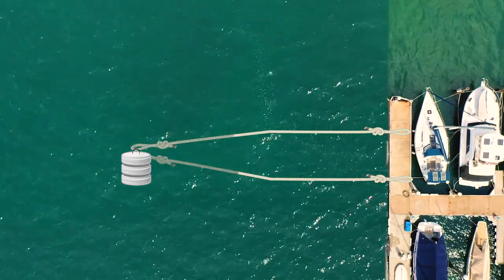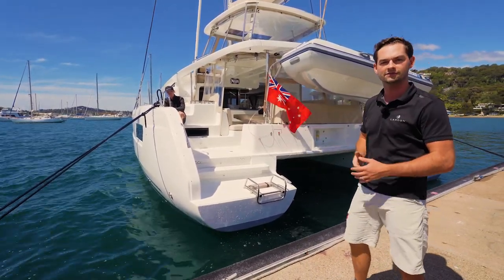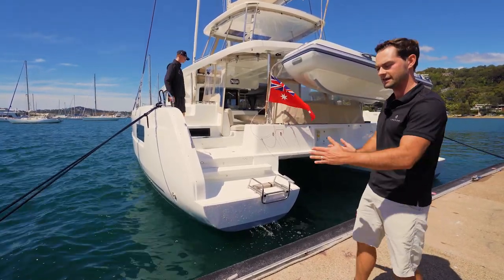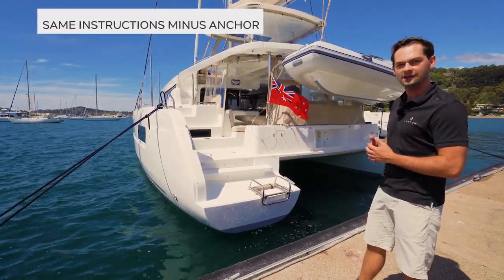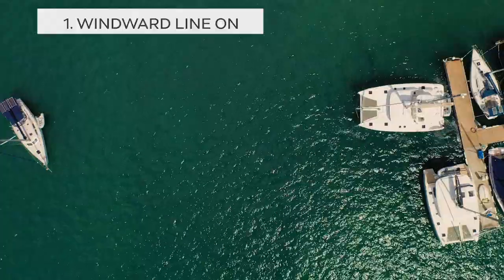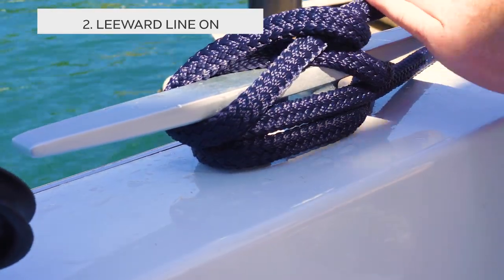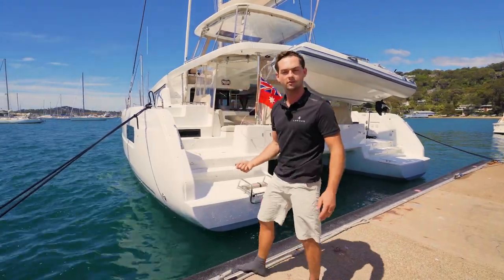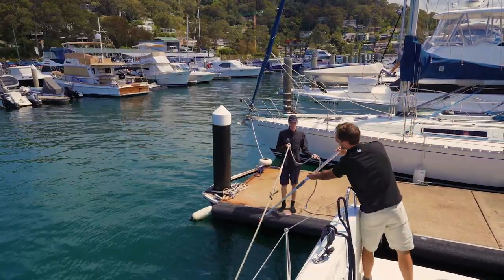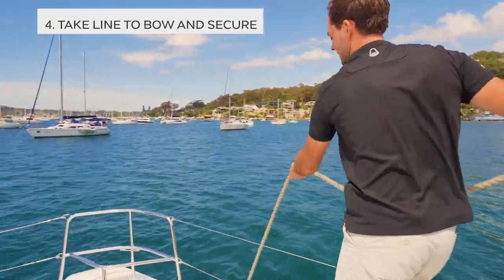There's a small line which comes to a cleat on the dock, runs underwater, becomes a big line, and then goes to a concrete block. The approach is exactly the same as before except you're not dropping the anchor — you're just reversing into the dock. Again, if there's a boat already on the dock, put fenders down one side and go on the windward side so he can catch you as you come in. If not, you do exactly what we just did: come stern first into the dock, get your windward line on, drive on that to control the boat, then get your leeward line on. Once you've got two lines on, grab the mooring line — there'll most likely be someone on the dock to help hold it up — and you'll be able to grab it with a boat hook. Hand over hand, walk it forward to the very bow of the boat, pull it tight and make it off on the cleat.